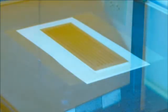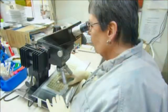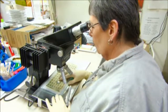Then they coat the laminate in a light-sensitive chemical and apply a plastic film with an image of strain gauges in negative format. They expose the setup to ultraviolet light; the light-sensitive chemical reacts, imprinting the images into the laminate's metal surface. Now they have rows of strain gauges.